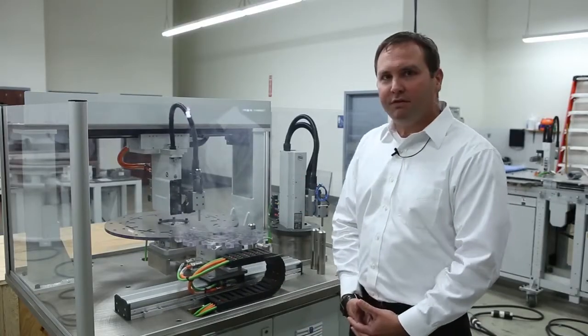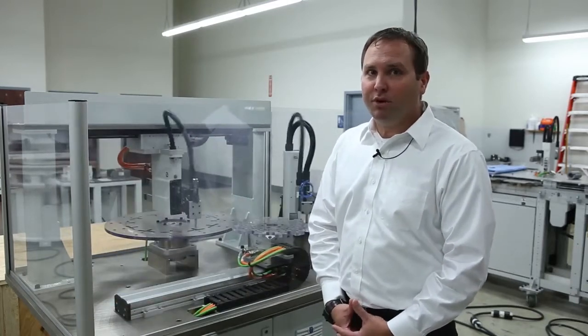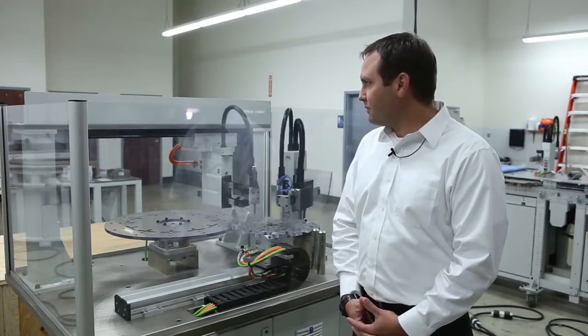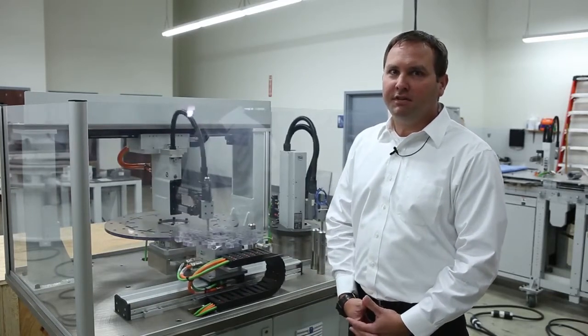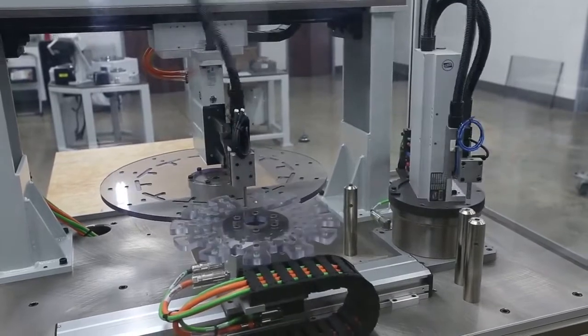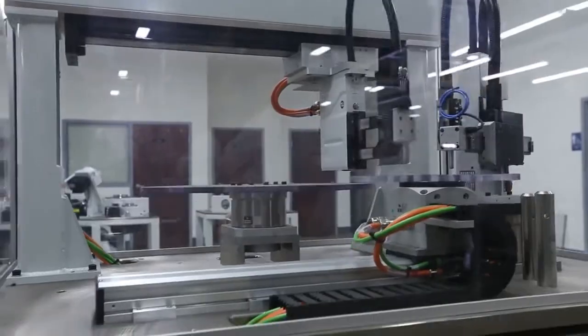The HPs are all 0.01 millimeters of repeatable accuracy, and the HNs are offered up to five microns of accuracy. We also have our HG series — an aluminum extruded version of the HN — with an HG 25 and HG 12, up to one meter stroke lengths. Our ST 140 torque motor riding on the HG is good for handling and rotating small products to be picked and placed onto another index table. We also offer the TO 150, TO 220, TO 750, and TO 1300 — a 1.3-meter diameter torque motor, which is one of the largest torque motors available. Our HN series is offered in a range from an HN 50 up to an HN 400, covering 15 kilogram loads up to 100 kilogram loads.